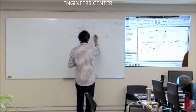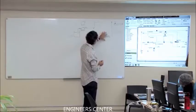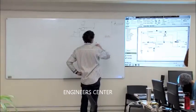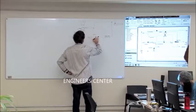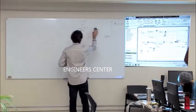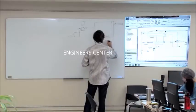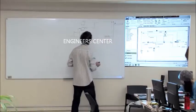And H3. So you guys would have had to have had some sort of control valve on this. The raceway return, you can't really control the raceway return. That's going to basically be coming back from the DAF unit. So we pretty much have to take, the majority of the water is probably in the raceway return. And then this is really just handling evaporation and losses and stuff like that. So if that's the case, I put the ammonia in the wrong spot. Okay, so the ammonia's got to come in here. Okay. We're trying more of a P&ID than anything else.